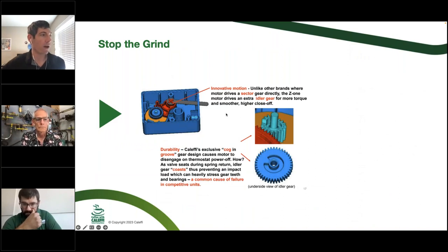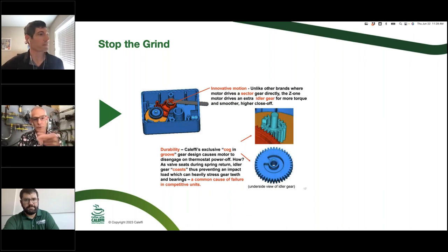When you put power to the motor, a little synchronous motor winds open and opens the valve. When you take power off, the spring — a wound rotary spring — closes the valve. As the valve opens, it winds all that spring tension into the paddle. When the paddle closes on other brands, it hits the end and bounces once or twice as spring inertia winds out — that's where water hammer comes from, a banging sound as the paddle tries to come to rest.